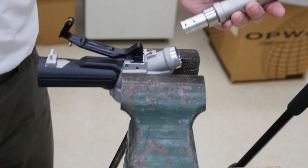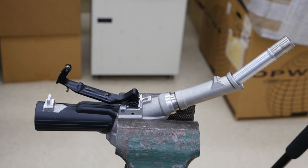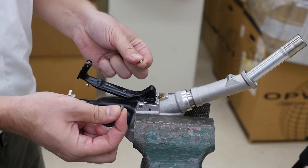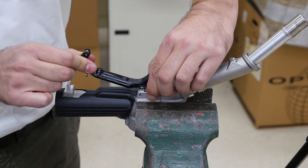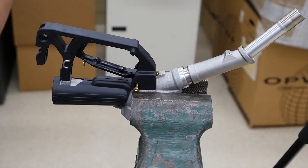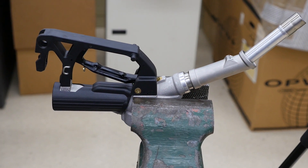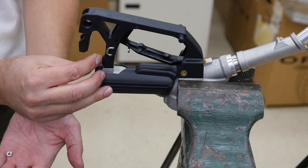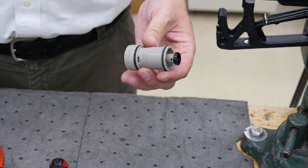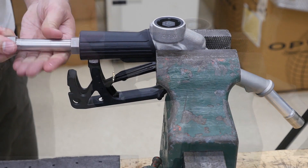With the nozzle body in the vise, gently push the lubricated spout into the nozzle body until you feel the o-rings seat. Be careful to align the hole in the spout with the hole for the spout pin in the nozzle body. Install the o-ring and the spout pin. Next, install the lever pins on each side, being sure that you install them with the opening facing out. Install the guard assembly and tighten the barrel screw. Put the lock washer on the guard screw and use the square backing nut to secure the guard. Finally, place new o-rings on the vapor inlet assembly and lubricate them. Reinsert the assembly into the nozzle body and tighten until snug.